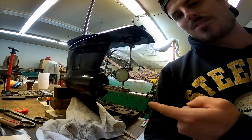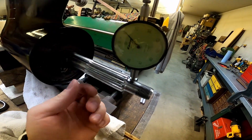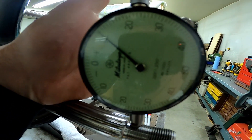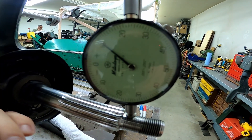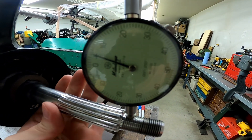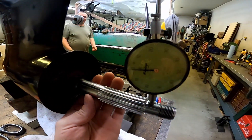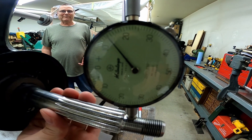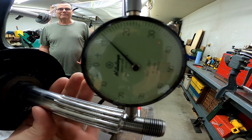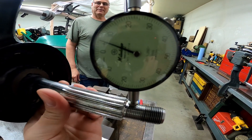When I got here this morning to have a coffee, dad showed me this as well. So let's just watch the runout on this gauge here — this is our drive shaft. So normal acceptable runout is 6 thou, I think up to 9 thou. Let's bottom this thing out here. You can see it already. There's zero, and we've marked the end of the drive shaft. Watch how much runout this has: 10 thou, 15 thou, back down to zero. 15 thou, back down to zero.